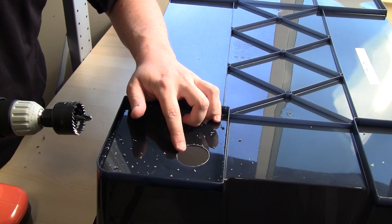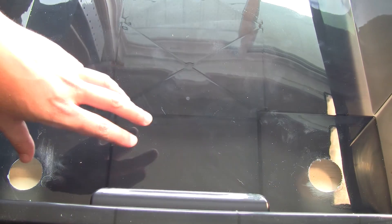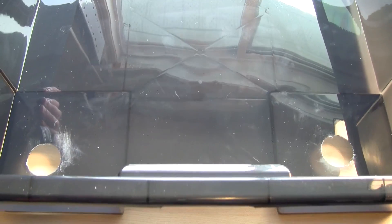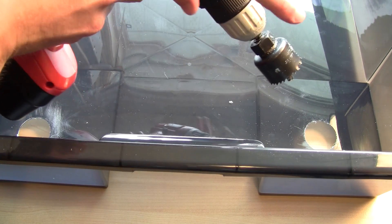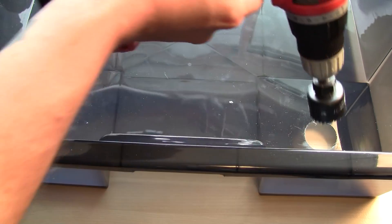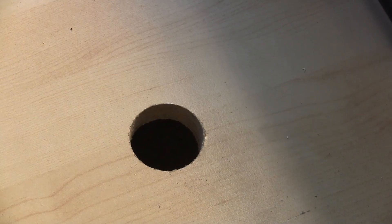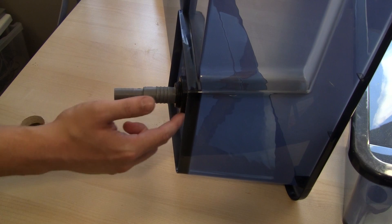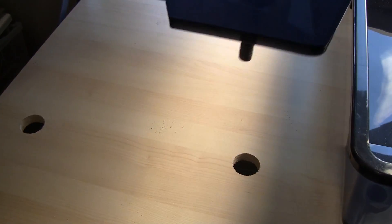I have my flood and drain hole drilled out, but I'm also going to need a separate hole for a separate bulkhead on this side to allow for an overflow. We're going to have to make some modifications to the desk — I need to put a hole in the desk for one of the bulkheads on this side and one on this side. So I'm going to place the unit right where I want it and then, using the same drill bit, cut a hole right into the desk. Now we have the hole in the table, and that's going to line up with the hole in the growbed, and now we can add our bulkhead. We want to have the bulkhead nice and tight with the pipe coming out, and we should be able to just fit that right over the holes that we drilled.